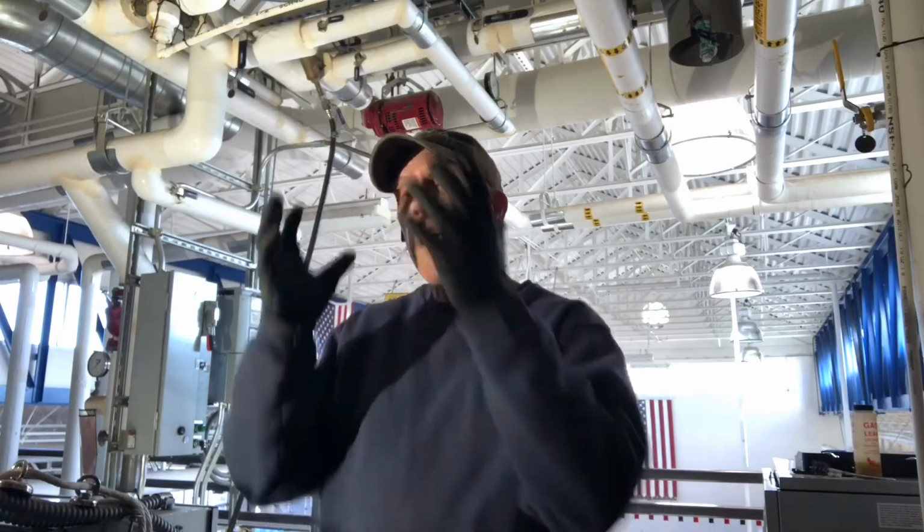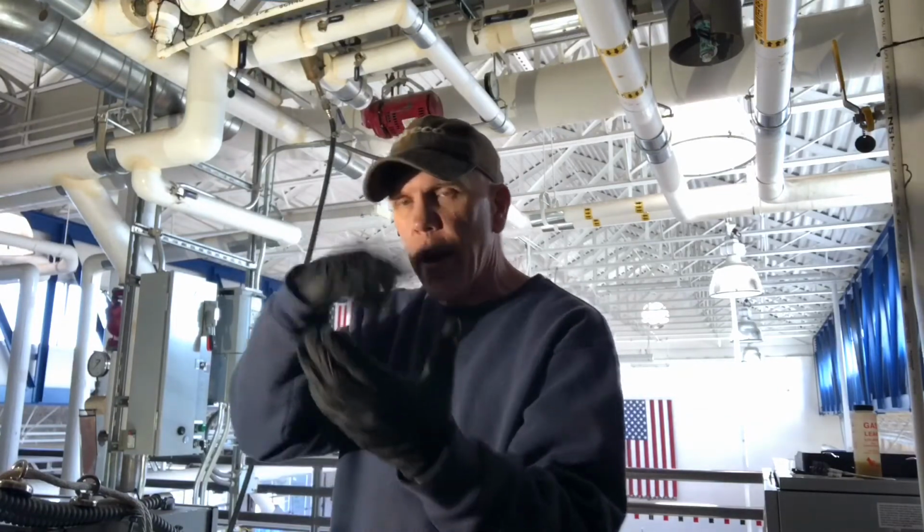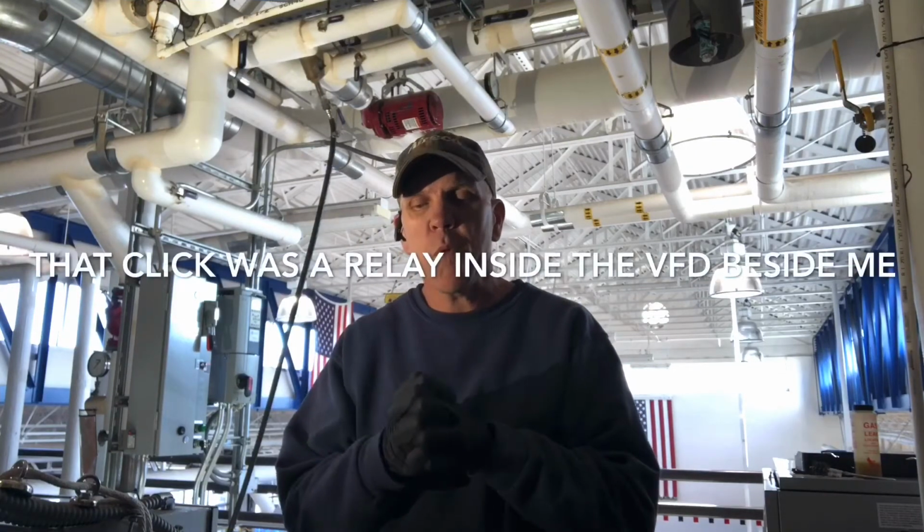Because when you're putting that pump back up, you want it to be level so you can slide it back in. That way you're not going to tear your volute gasket or mess anything up that you're working on. So that's pretty much what I'm going to show you, and I'm going to go ahead and get started on it. I'm going to be speeding up through it until I drop it, and I'll show you what I'm doing there.